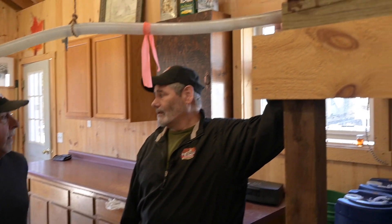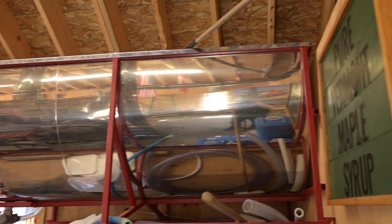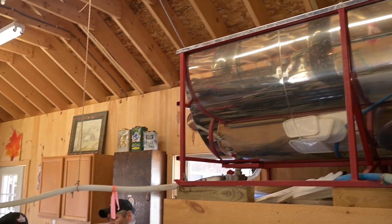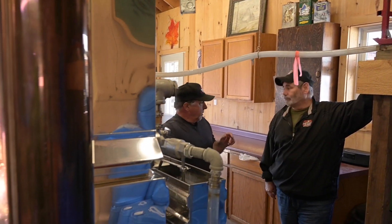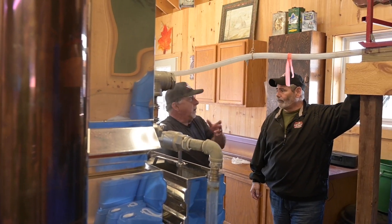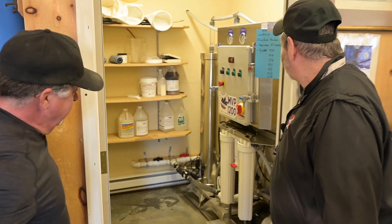This is your concentrate tank — yes, 300 gallons. That's what you feed the steam away. With it full at 12 percent, we can boil it off in three hours, so that's about 100 gallons an hour of concentrate. We're doing about 14 to 15 gallons an hour in syrup, depending on the concentration level.